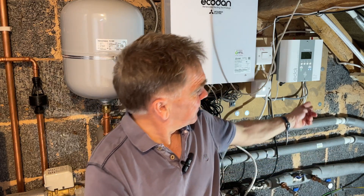There is something worth knowing: underneath the Eddy at the bottom there's a three-way switch, which is on for me — as it always has been. I can also switch it to off, which will kill the electricity supply to both the Eddy and the immersion heater, or bypass, in which case the Eddy will be turned off but there will still be power to the immersion heater.